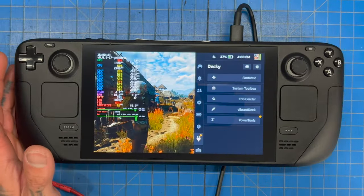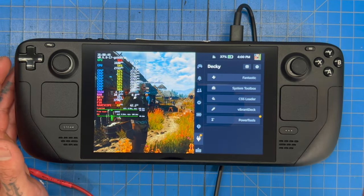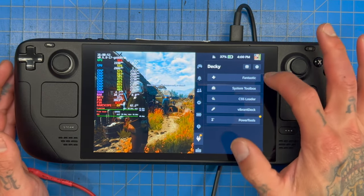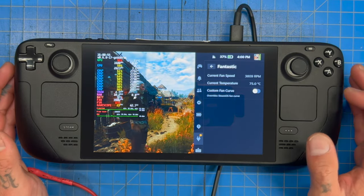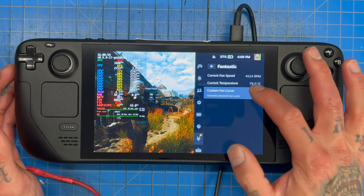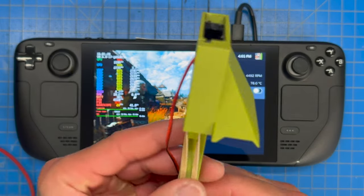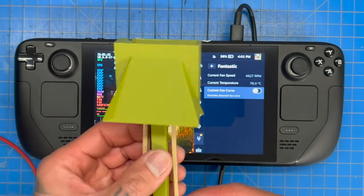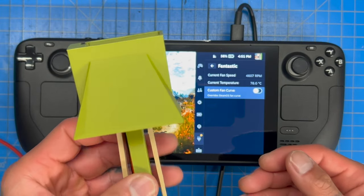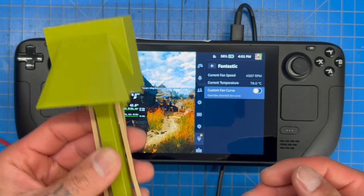So real quick, if you don't know what Decky is, you need to download it. I'll send a link to maybe a video or a tutorial to do that in the description below. And you need to download the Fantastic app. So that's this app right here. It allows you to control fan speeds on your Steam Deck. You need to have the Decky Loader and Fantastic, or you're not really going to get the best benefit out of this. Maybe on average a 3 to 4 degree delta. In the best case scenario, you'd probably get a little bit higher than that, close to 5 or 6.